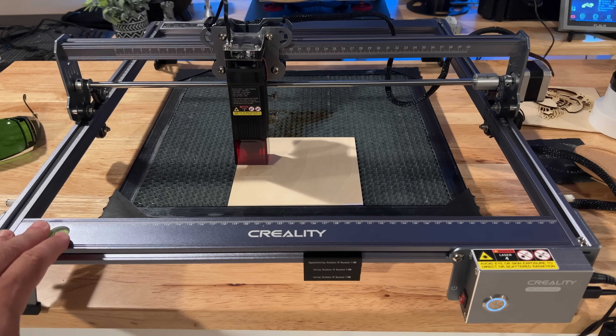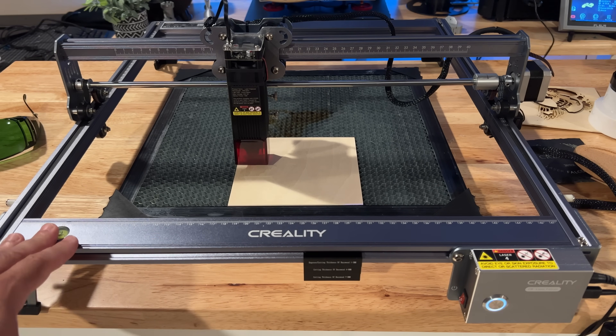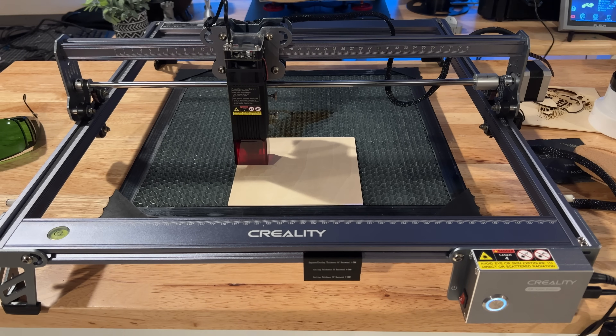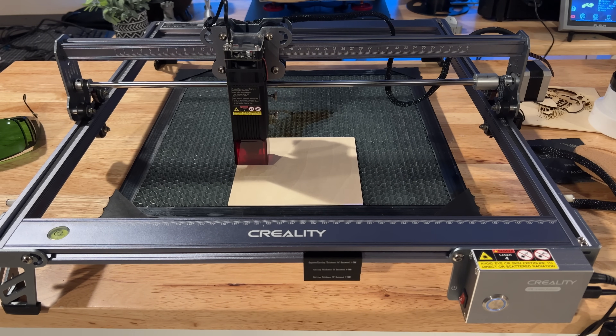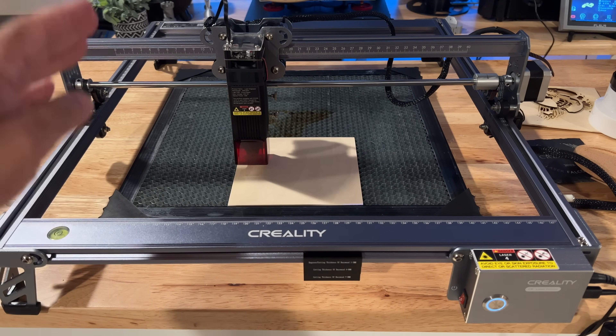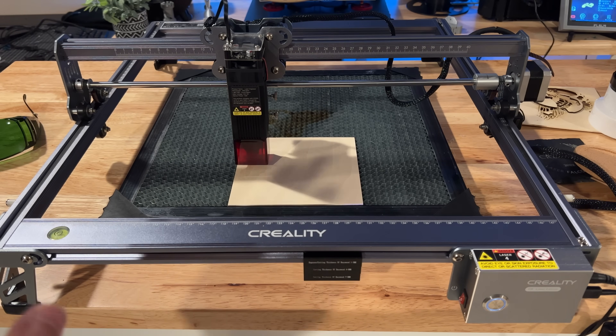This one's going to have a 0.06-millimeter precision when it comes to engraving, 12-millimeter one-pass cut. It shares that ease of use we saw with the previous laser. The big deal here is that you have a 10-watt laser compared to the 5. What it's actually doing to get that 10-watt is that it has six lenses that converge, giving you kind of that high resolution and also that high power.